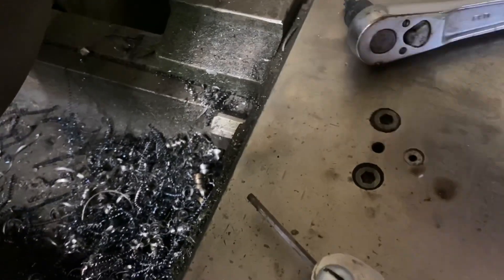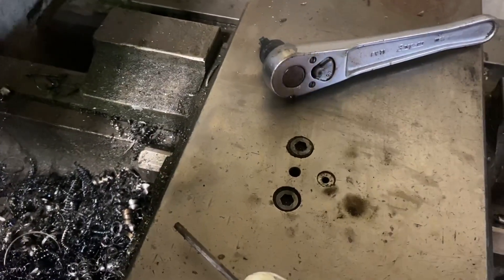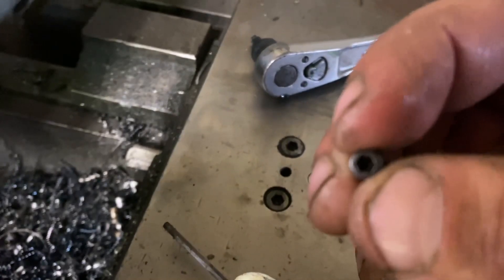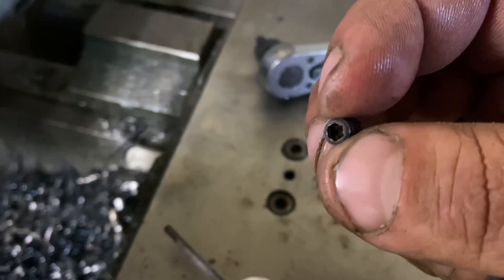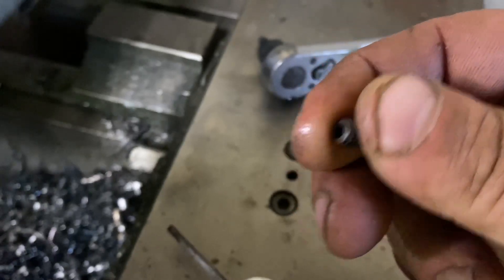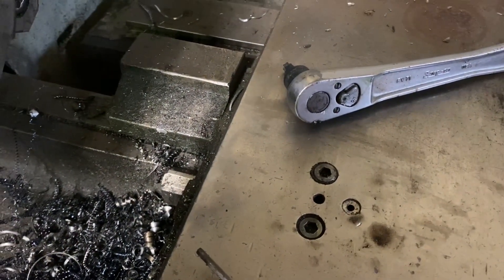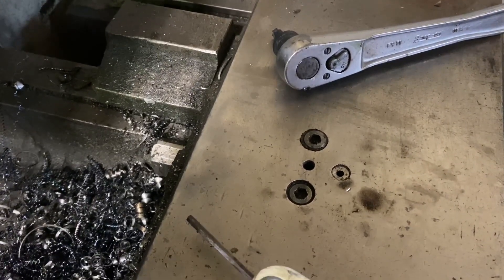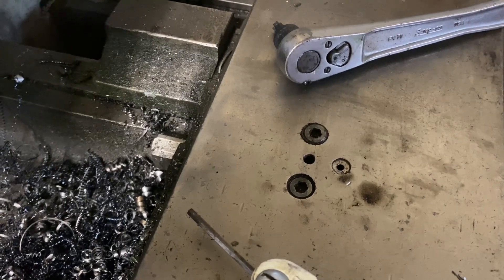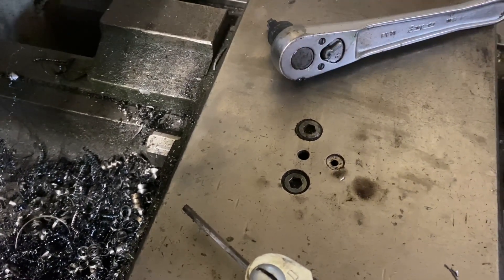If you didn't watch my short video yesterday — the first thing I did with little set screws like that, especially ones that are recessed, I got the old one out. I didn't even try to tighten it before I removed it because it was a little buggered up. Ever since Torx bits became a lot more prevalent, people won't even try to find the right Allen bit — they'll just jam a Torx bit in things. Set screws are ruined an awful lot by that.